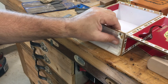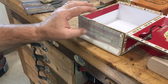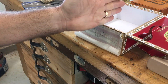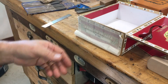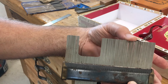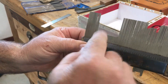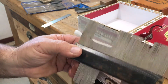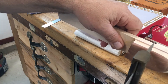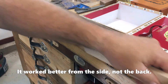I've put some low-tack tape on the side of my box and I've drawn in my two center lines where I want to have the neck of the guitar come down. I've used this gauge which is an impression gauge — it just moves and copies the contour of anything. I used that on the back of the neck to get my contour and try to get the proper radius for the bottom here.